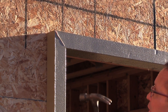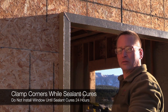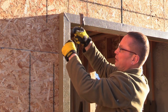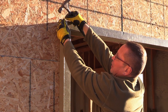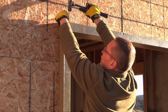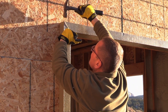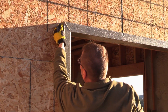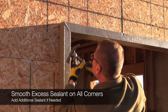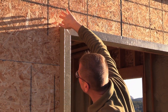Now I'm going to show you how to clamp the corner to hold it till the sealant cures. We don't want you to install windows the same day you install the Thermal Buck — we want it to set for 24 hours first. We take two of the roofing nails and drive them in to hold that corner tight. With the high-density foam, it will not let it move. Any excess sealant that oozed out, we smear it in to make sure we have a good seal.